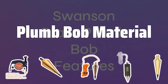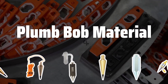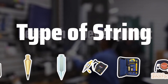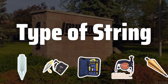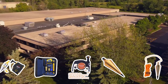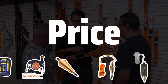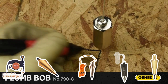The material of the plumb bob matters — brass for heavy outdoor use, steel for indoor projects. Choose according to your working environment and needs. The type of string used is crucial for accuracy; avoid stretchy or moisture-absorbing strings, and be aware of twisted ropes or stiff lines that can impact the vertical line. While the tool is simple, don't overspend — an affordable plumb bob can get the job done just as well as an expensive one. Consider your budget and the value you're getting for your money.